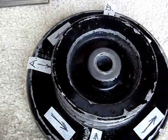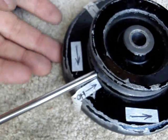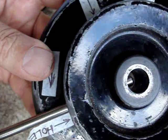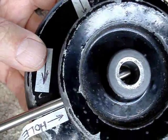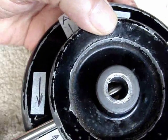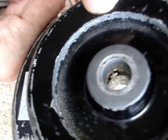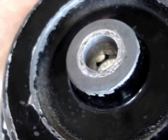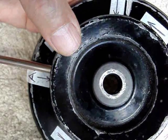The reason I'm asking all this is because I want to remake this thing — I need a bigger pulley on the machine. There's nothing here I can put a set screw into; this one is obviously just a hole. Or I could tap this hole — I could buy a pulley tap and tap the hole and put a set screw in it, probably American but maybe metric. But this other one — the one with barely any threads — oh my god, it just went through there too. So for all intents and purposes, hole A is stripped.